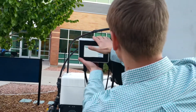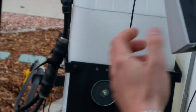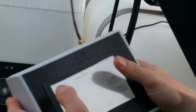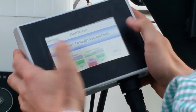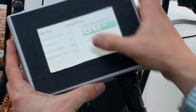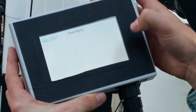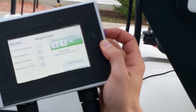All the changes are saved automatically. To demonstrate that: if I change this value to 2000 instead of 1600 and enter that using the keypad, then turn it off and turn it back on again and go to the setup menu, you can see that the change was saved. There are other features, but those are probably the biggest ones in the design to show you that it works.